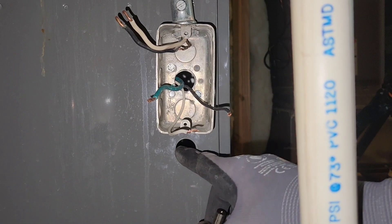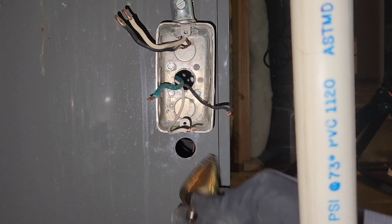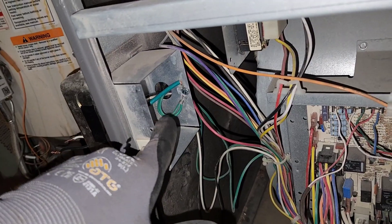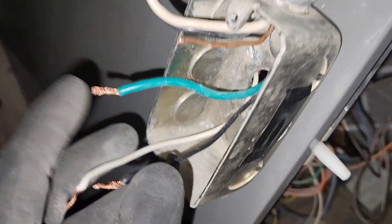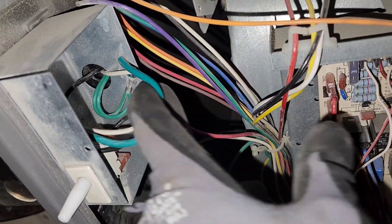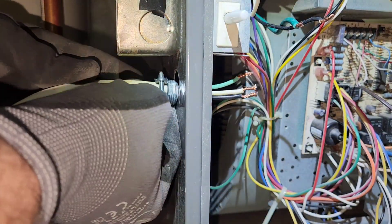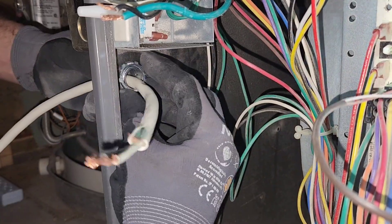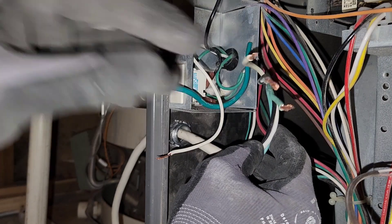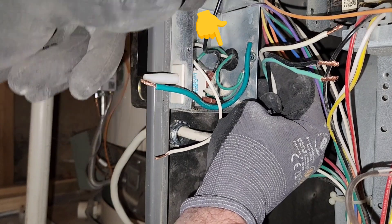The outlet is going to be here and I'm going to have my plug coming out through this hole. I'm lucky my furnace already has one of these holes drilled, but you can get a step drill bit — I picked this up at Harbor Freight — and drill a hole in the side of the furnace. Let's go ahead and wire the plug in first. I am just going to push these bottom three wires through this hole so they come out the back, and then I'm going to feed my pigtail plug into my furnace to connect onto those wires. I am going to add this wire clamp to protect the wires from the sharp edge of the furnace. I trim these wires back a little bit and feed them right through this hole with the other wires so they all come into this box.